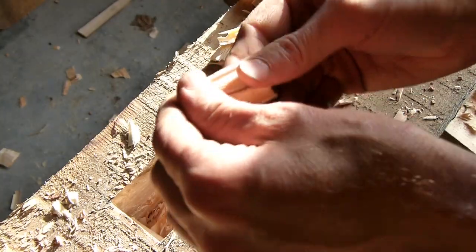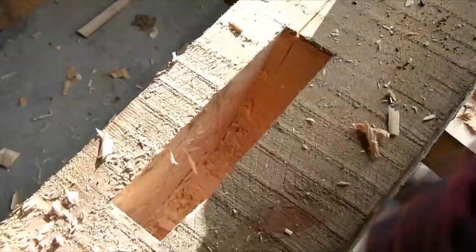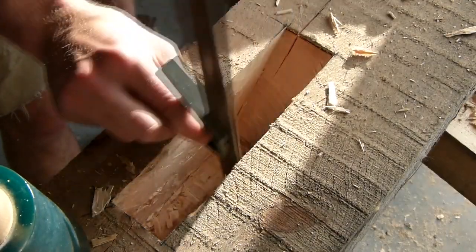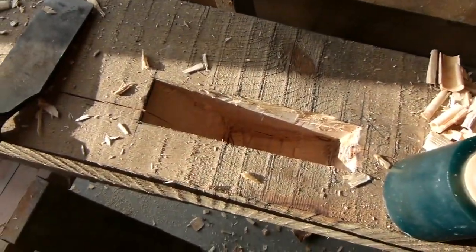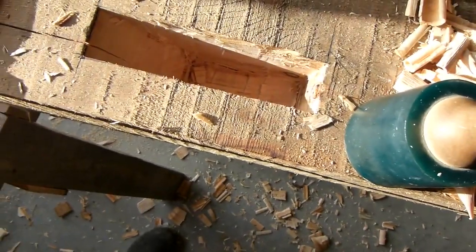Kind of neat how sharp tools give you the idea of the structure of the wood. Test the hair — three and a half all the way around. It's June 29th, 2017 and this is my inaugural cut into the timber frame of the house from trees. Five inch long, three and a half inch deep.